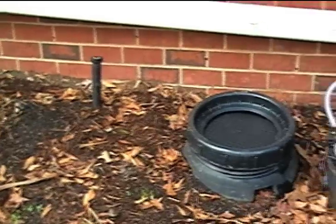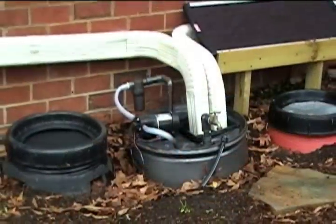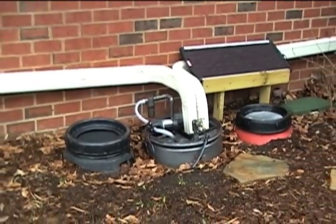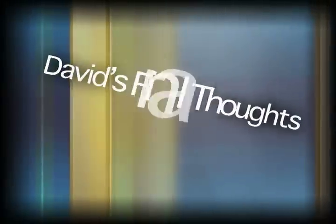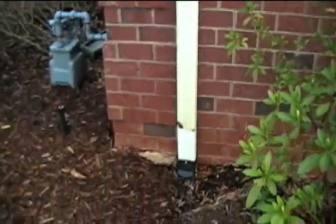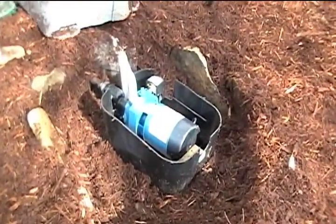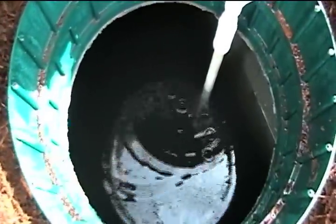There is a 12 volt battery and the solar panel ensures that that battery is fully charged. Similar to the larger cistern system, these barrels are buried as well to improve the aesthetics of the area. Once the landscaping is up, these barrels will not even be noticeable. Typical rainwater collection tanks are above ground, very visible, and not the most attractive feature to have in the landscape. This one allows you to disguise it but yet have tremendous capabilities.